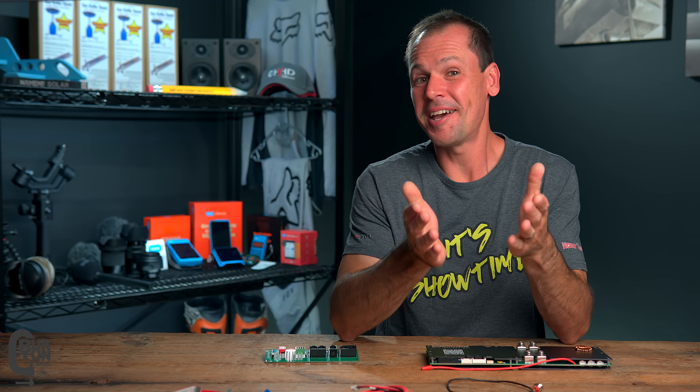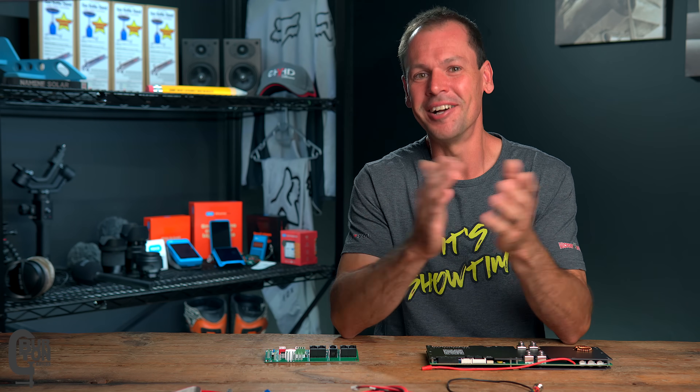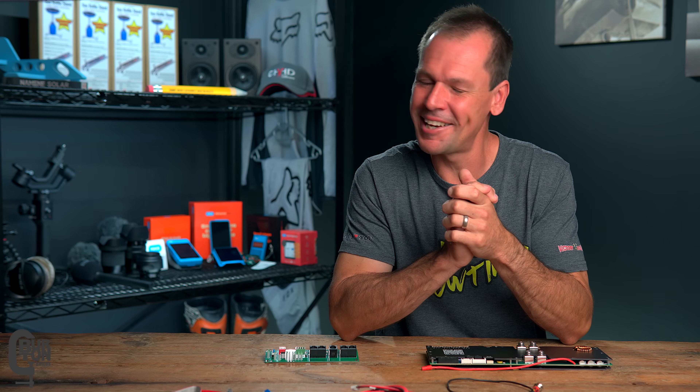This is something you guys can help with — I'm not 100% sure about this, so please let us know in the comments. I think if you're using the 4.3 inch LCD touchscreen, it needs to use two connectors: the LCD interface and the RS-485 interface. If that is the case, this means the RS-485 port can't be used for anything else at the same time. If you're able to help, let us know in the comments.